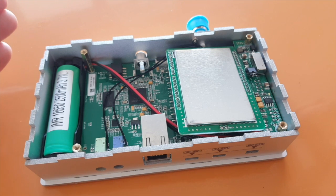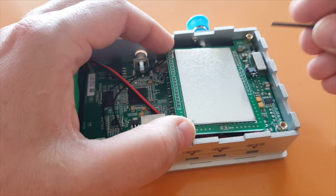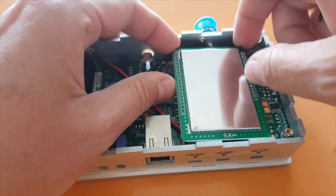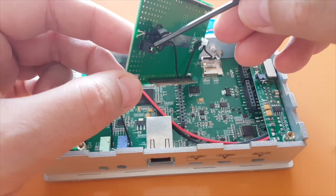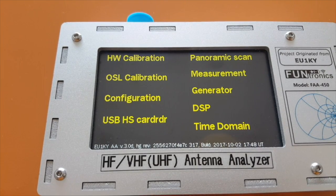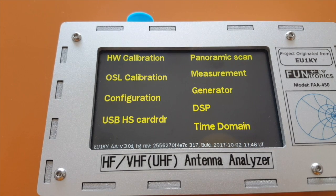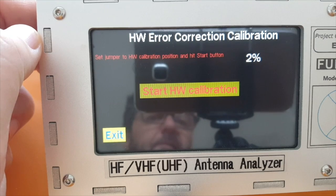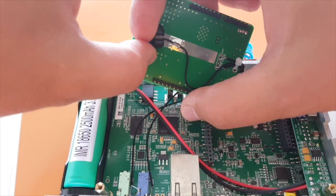Now you're supposed to redo the hardware calibration, and there is a jumper to set to that position. Unfortunately I can't see it, so I suspect it might be under this board, and removing it is something I just didn't want to do. I think that's the one right here. Why this isn't done when you buy it, I don't know — the hardware calibration has to be done anyway, so why not do it for UHF as well? Nobody's going to buy an analyzer capable of doing UHF if it doesn't do it. And of course I need to reset the jumper, which is a pain.